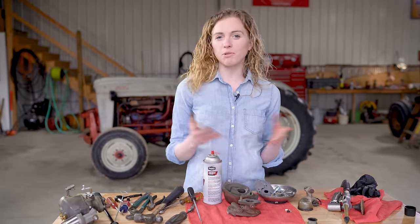Once you have it correct, then you're ready to flip this over and put the door inside. Your new door has this air passageway spring set up here. If you had an original door, it might have been solid, but this is an upgraded choice. This is directional, so I have my carburetor sitting up like this with the bowl down, and it's gonna slide in just like this. On the choke shaft, there's a slit, and this plate goes through the slit. So I'm going to pick this up, I'm gonna drop it through the slit, and then I'll turn it up. Once I have this orientated correctly, I can hold it in place, and from here, I put both of my screws through the shaft to hold that plate onto the shaft.